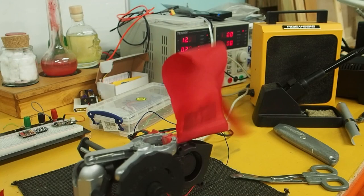And some magnets. As I wasn't quite sure how this effect was going to work, I decided to prototype with smaller and simpler components. I got some little dinky fans and taped some material to them, experimenting with different shapes. One key thing I learned is that the material needs not to be folded or creased, because that provides stiffening. The other key thing is to place the material right down the centre of the airflow, so we've got air going both sides of the material — that causes the flickering effect.